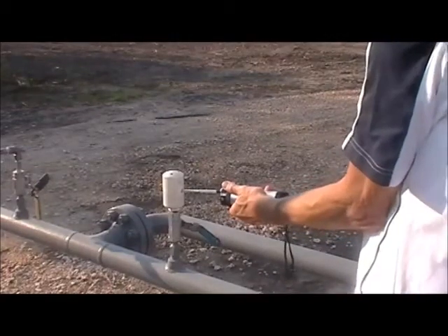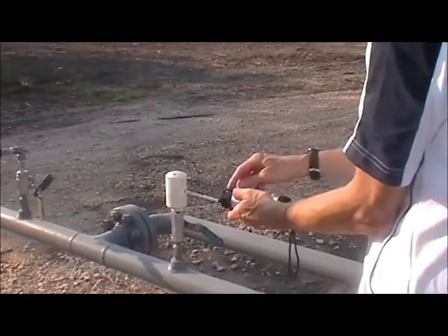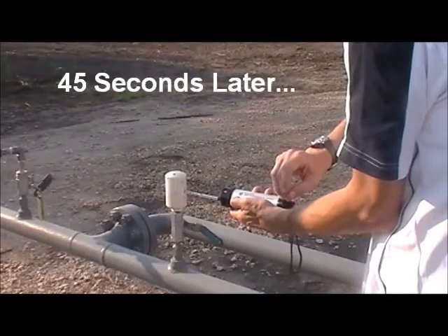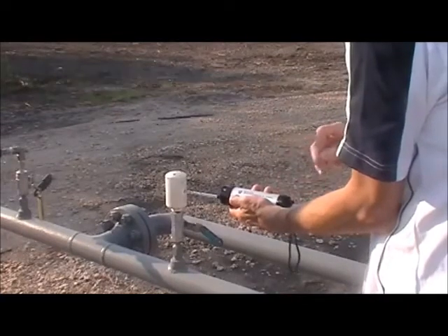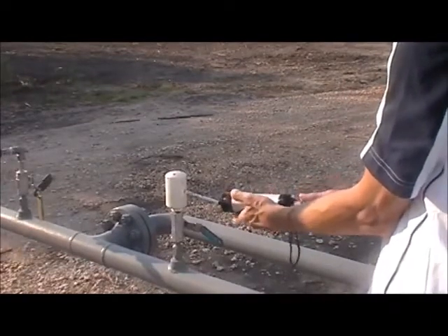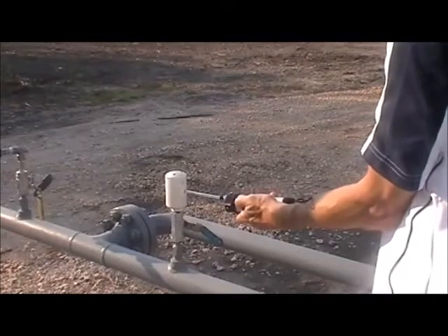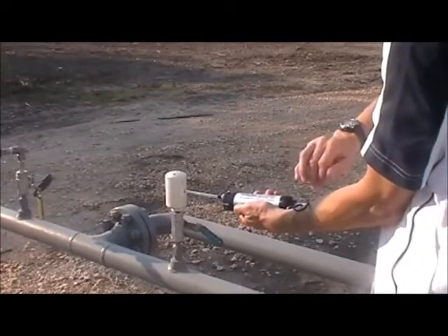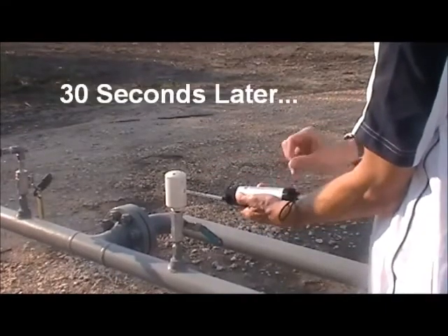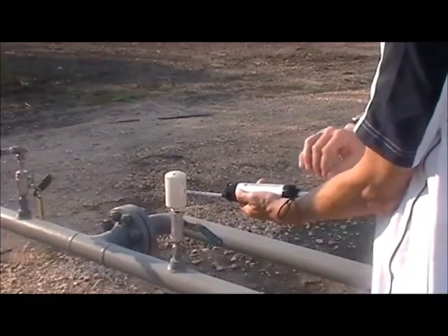Take your two strokes. Wait for the end-of-flow indicator to indicate that your minute of sampling time is up. When the sampling is complete, rotate the handle 90 degrees, push the handle in all the way, and pull a second stroke. Make sure to align the dots on the pump and the shaft. Now you can see the color forming. The vacuum flow indicator is almost finished — the sampling is complete. It's been one minute.